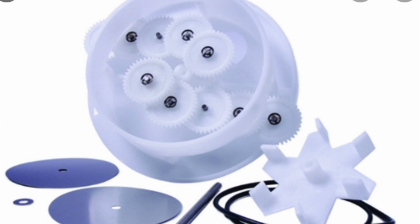actuator. So as I mentioned earlier, you're going to make sure that's lubricated and clean, obviously not cracked or broken, and make sure it's seated in place when you put it all back together, because you don't want any leaks in that dome. Remember, you're not putting the guts back in, you're just removing one of those valve covers inside, or zone covers, or you're removing them all depending on what you want to achieve.